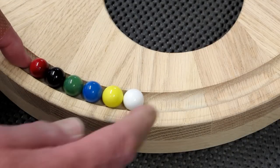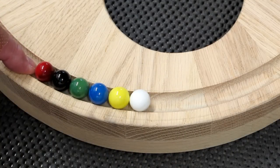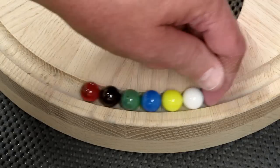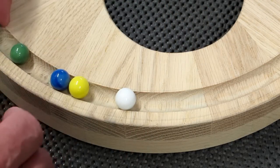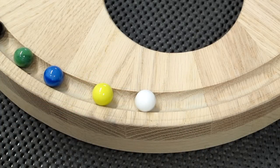If we fill this trough with marbles, each one is turning in the same direction, and when they touch, one is trying to slow down the other. You end up with a lot of drag. And that's true for the bearings as well as the marbles. So really, we want to get these spaced out so that they're running around this trough and not touching each other.